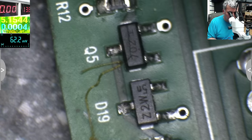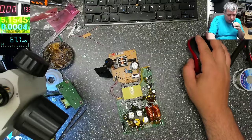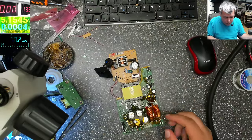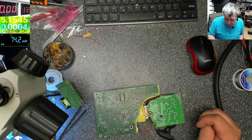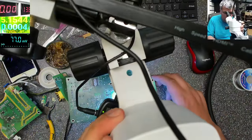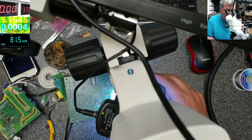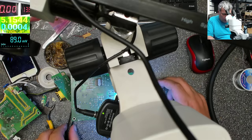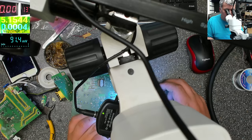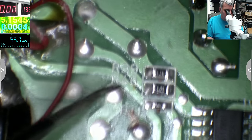This is going here. Wait. I'm wrong. If here is no voltage, I mean, there's no reason for this opto thingy to have no voltage there. So I should have voltage here. This is coming from a pin. Yeah, what did I tell you? So even this one it's using, you can't see, sorry, it's using signal from the transformer.